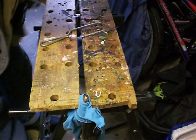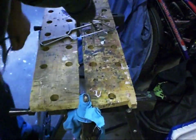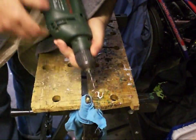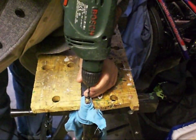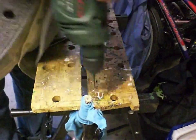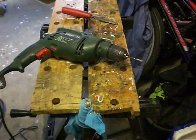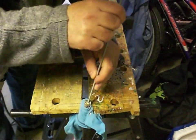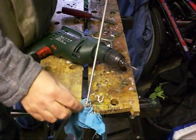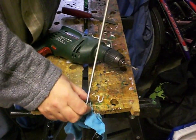With the drill on very, very slow — I'm going to adjust the speed right down on my drill — to very carefully try to drill out the stub of that dowel. I'm using a drill that's slightly smaller than the diameter of the dowel. My intention is to glue in a piece of threaded rod, glue that in with epoxy, and then build a new handle on this metal stub.